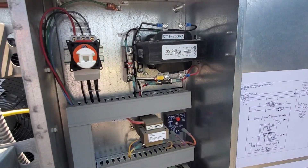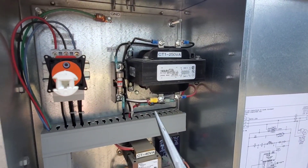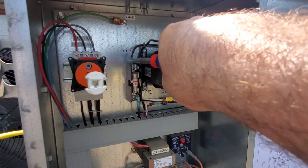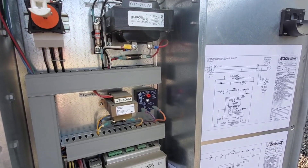Power's off and it's been verified, so we're going to check all the electrical connections. After checking all the bolted down connections, we want to tug on the Stacons wherever they are within the system and make sure they're nice and tight.